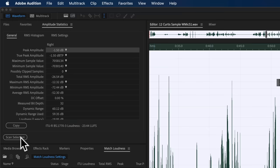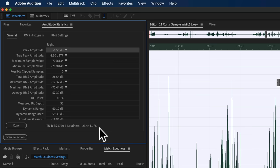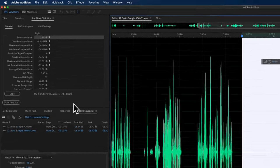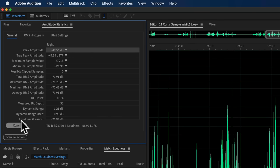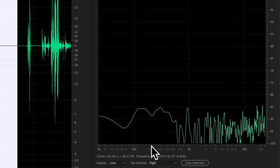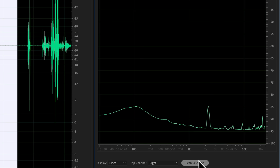We did our practical noise floor sample — we loudness normalized to minus 23 LUFS and then we measured the silent portion. What we found is that this came in at minus 71 dB RMS max, which is actually quite good for a consumer wireless system. It actually came in quieter than my Audio Limited A10, but there's a little bit of a wrinkle to that, which we'll talk about more in the cons.